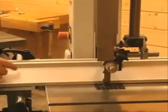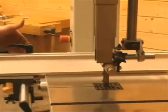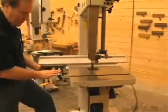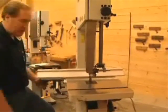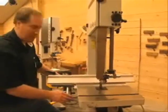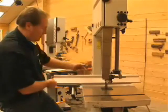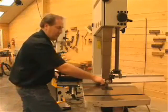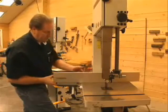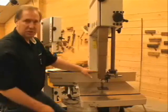For the next thing, we're actually going to do a drift adjustment, and I'm going to flip the fence into the high position. I'll slide it back, and you're going to notice that when I do this, the bandsaw works just like any other bandsaw fence. It glides back and forth very nicely on this hard chrome steel shaft. There's a lock handle on the bottom so I can lock it in place and it won't move. So let's go from the low position to the high position — simply done by unlocking these two knobs on the back, sliding the extrusion off, flipping it 90 degrees, bringing it right back on, and locking it down. And now we've gone from the low position to the high position, again with no tools.